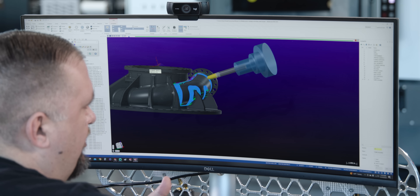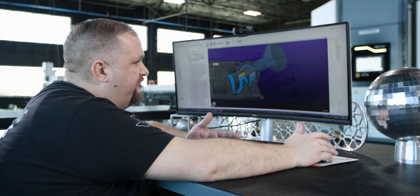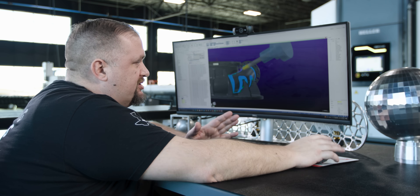If you take a look at how our spindle orientation is reacting to these vectors, you can see that at different points along that surface, my head is actually tilting to try to follow those vectors as close as possible.